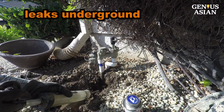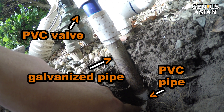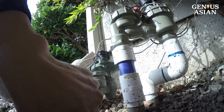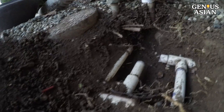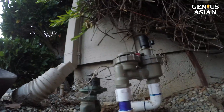So we dig a few inches down below the soil surface. What do we find? That metal pipe is, in fact, just a few inches down connected to a PVC pipe. We probably could have saved a lot of effort had we gone down and started at the original PVC pipe, and just connected PVC rather than trying to connect to the metal.